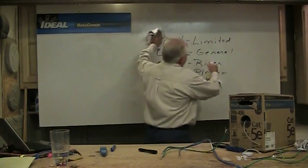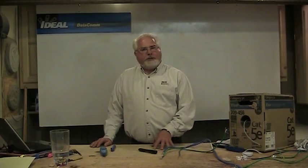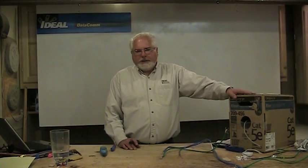The next thing I'll talk about is how to install the wire — some tips on pulling and general ideas as you route wires through homes. We generally like to be the last person on a job, especially in residential, before the walls go up, so we can pick routes that no one else is going to mess with. Take a look at the plans or drawings, and come up with ideas for routing wires and protecting that wire in the process. If wire is exposed, it can get damaged, painted, or have something stupid done to it. Make sure the pulling areas are nice and clean, with no other trades in those areas stepping on your wire during installation.